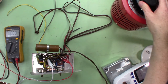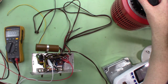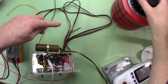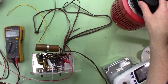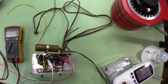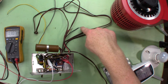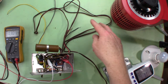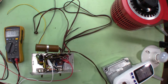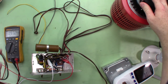It's on, I'm going to start turning it up. We're up to 55 volts and we don't have anything. I think I need to do something with those wires because there's a switch that cuts this on. Looking at the schematic — the white wire connects to the black motor wire, and the red wire powers the amplifier. So I twisted the white wire to the red wire, so the amplifier should be getting power now. Voltage is back down, starting to go up, and now we're seeing a voltage.